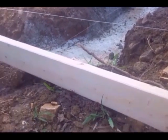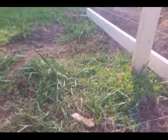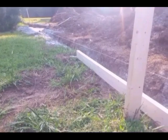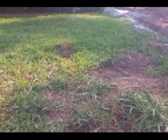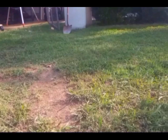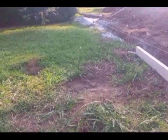The driveway slab right now is pitched the wrong way. It's pitched towards the backyard, which is going to send the water towards this garage. So I need to make sure my slab in the garage is higher. That gives me room to pitch away from the garage. I only have 20 feet between the garage and the driveway slab, so within that 20 feet I'll have to build a little flume to make sure the water runs from right to left.